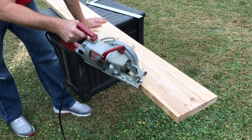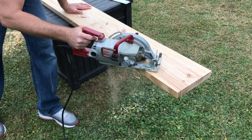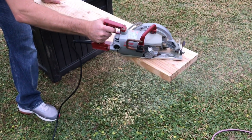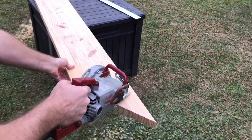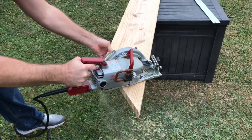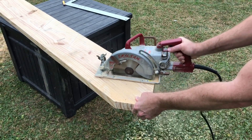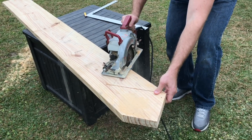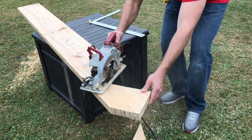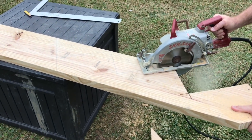Here I'm cutting the stair stringer, and I had my wife come outside and film me, so that's why I am rushing through cutting. I should have had this board braced better — on some sawhorses — and if I didn't have anybody to hold the board down, I should have had it clamped down. I'm cutting each step out, and you'll notice I do an overcut on every step. Now if I were cutting these steps for somebody's house, I would stop my saw before it got all the way through and use a hand saw to finish the cut so it wouldn't have that overcut look.